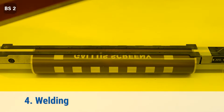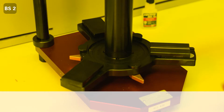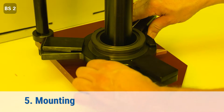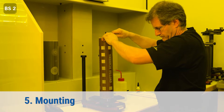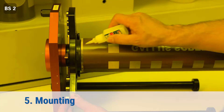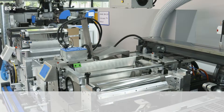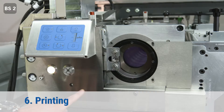What do you use to glue both ends together? In this system, we use a plastic string to bond both ends together. We've now arrived at the last step: ring mounting. With the dedicated tooling, ring mounting is also very easy — the mounting device secures the exact positioning of the rings. We also offer stencil rings with a modified surface to increase the bonding of the adhesive, providing more security in the printing process. From here, you install the cylinder in the print machine, install the squeegee, and start printing. That's how easy it is.